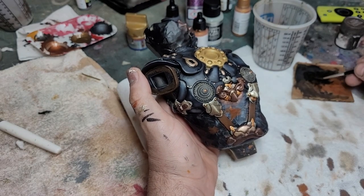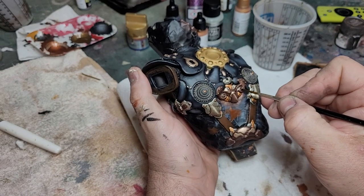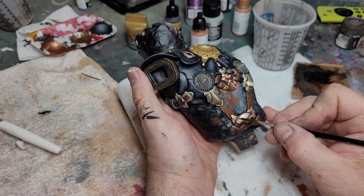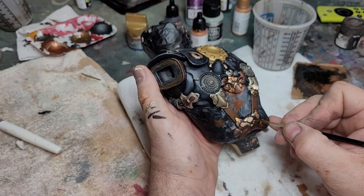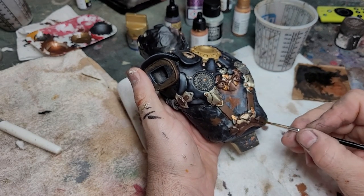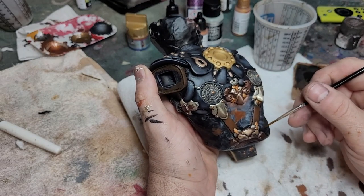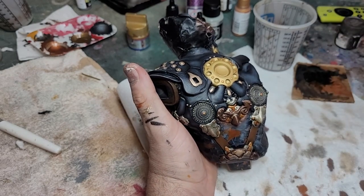And also, since I have this masked, I ran into this when I unmasked the legs, that some of the mineral spirits were running on my masking tape, which is not the end of the world because it just cleans off the paint on the body with mineral spirits, so it's no big deal. So this will just kind of help. See, I had some touch-ups there I wasn't too happy with on that paint. That's okay, because I'll put this on there, and by the time I wipe it off, it'll homogenize it a little bit.